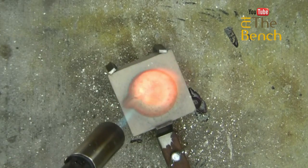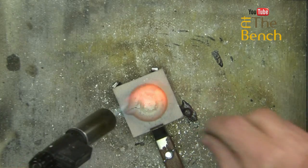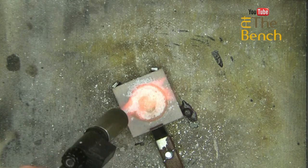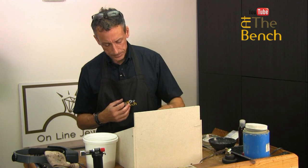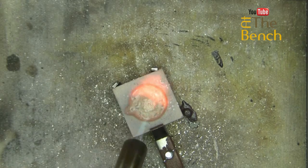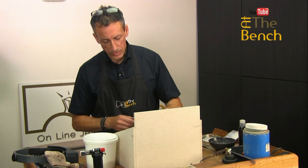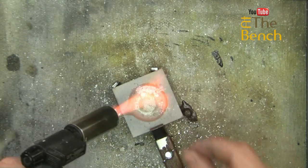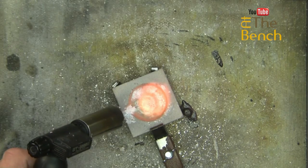You may be able to see in the camera that the centre of the crucible is now covered, but not quite the outside edge, so we're going to get a bit more flux, put it around the outside, making sure it's going to be nicely covered. The inside does have to be completely covered with borax — completely glazed. A nice healthy glow is coming from the crucible now. A bit more flux around the outside, and it is important to get that flux on the little pouring lip as well.